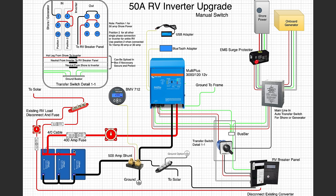Now let's look at the 12-volt DC side. Here we have the battery bank — often people go with a lithium battery bank setup. The positive cable comes in on one side of the battery bank and the negative on the opposite end, so the batteries are treated as one big battery bank rather than drawing from just one end. The positive lead goes to the inverter with a disconnect switch and a 400-amp fuse. On the negative side, it comes out of the inverter to the load side of the shunt.